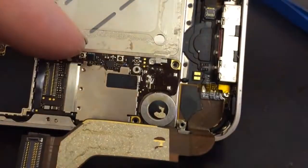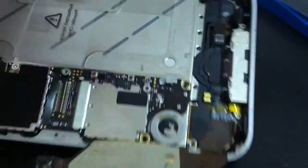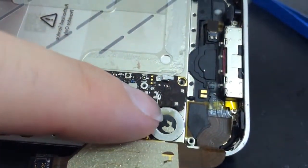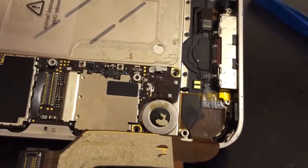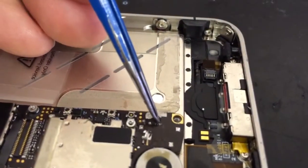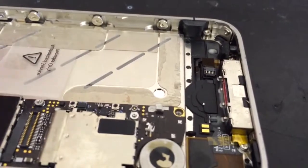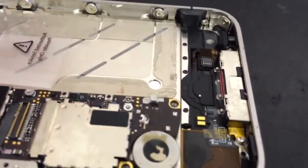Alright, then what we've got here now is the contact that we've soldered into the upper area that was left, and the single part coming down where we can solder the pin to from the connector. What we're going to do next though is solder in some strands of wire that go up here to address the issue of these pads missing. Once we've got that done, we'll solder in the connector on top.